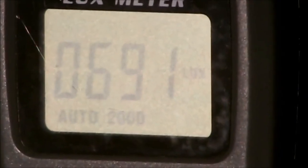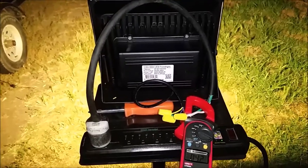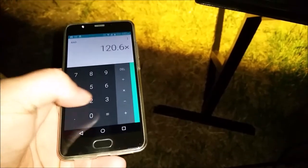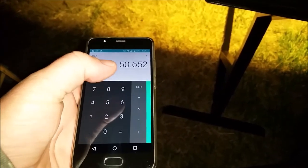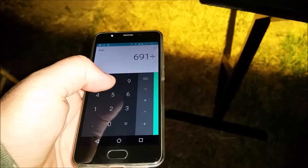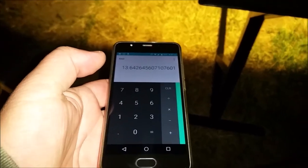Here is the second of the two Custom Fits — this is the larger of the two lights and it is pulling 691 lux. It's pulling 0.42 amps. 120.6 times 0.42 equals 50.65 watts, so as advertised. 691 divided by 50.65 equals 13.64 lux per watt — really efficient.